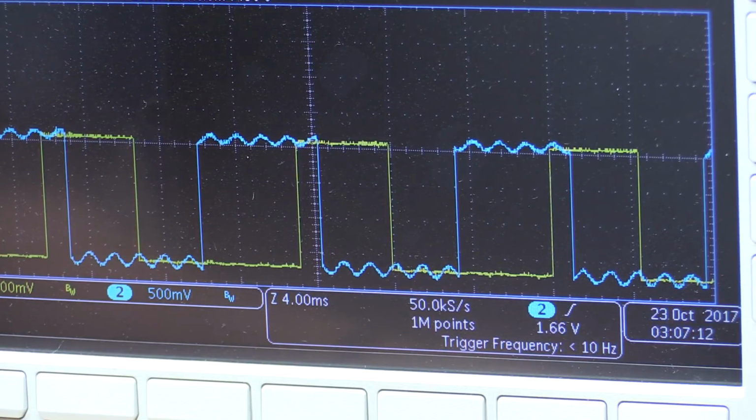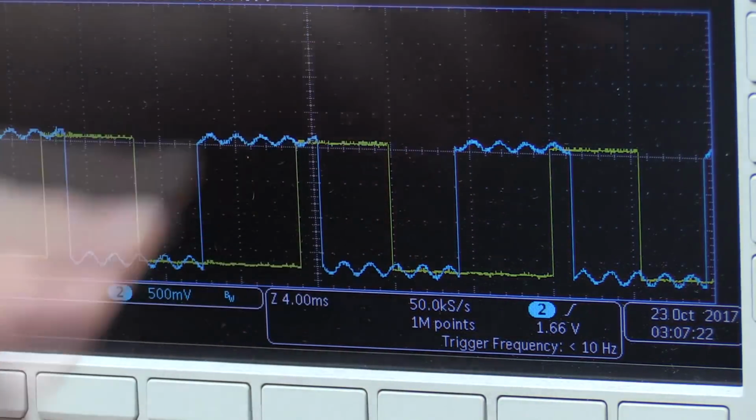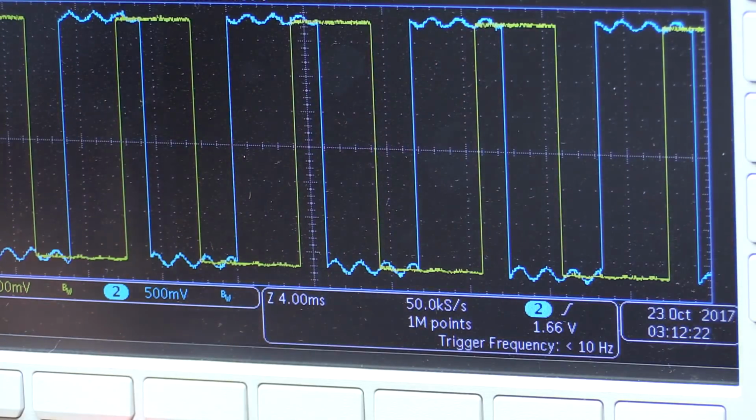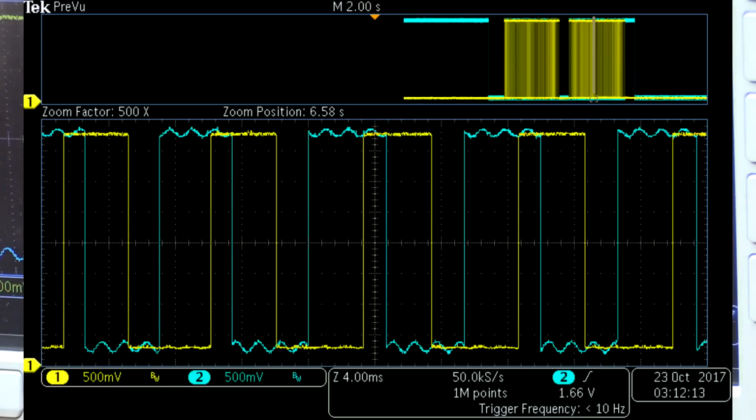And the signals we've got here, I'm supplying this with 5 volts. It looks like it's 500 millivolts, so the output is only going up to a couple of volts, not sure why. Okay, just a quick bit of feedback. I made a slight mistake there. I mentioned that the volts seemed to be low on the oscilloscope, and they were. But the reason was I thought I'd set 5 volts output on my power supply, but it was still set to 3.3 volts. So as you can see here, now that I've set it to the proper 5 volts, I am actually getting a much stronger output signal.